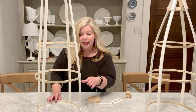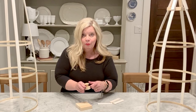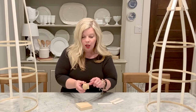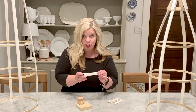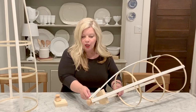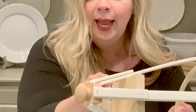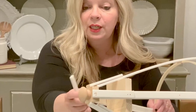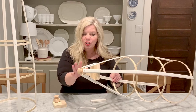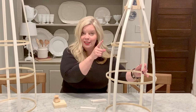To stabilize the top, we need three things: a larger block of wood cut approximately three and a half by three and a half inches, a small piece cut one and a half by one and a half inches, and a wooden knob attached to the smaller piece. You'll also need four pieces of wood cut four inches from the molding itself. Attach the larger block to all four sides of the molding, then attach the smaller piece on top of that with the knob. This completes the top and helps stabilize the obelisk.